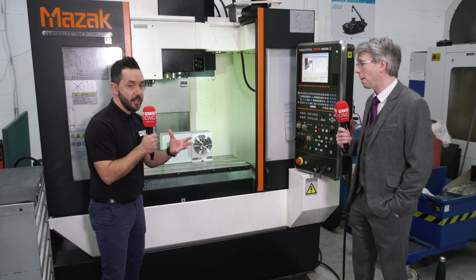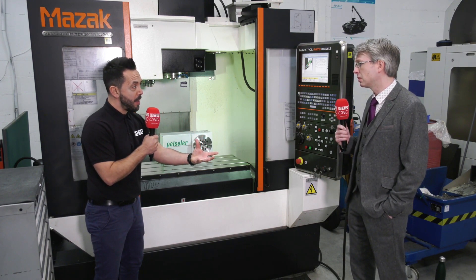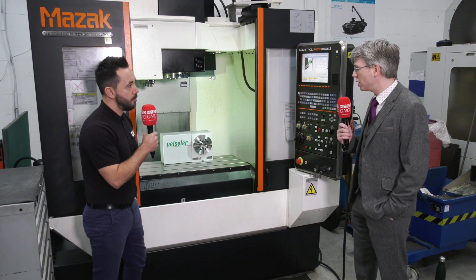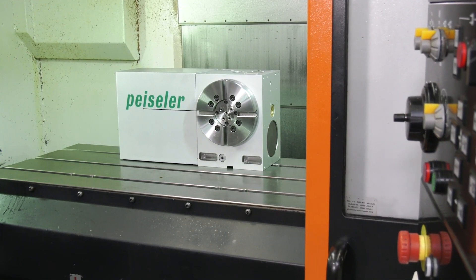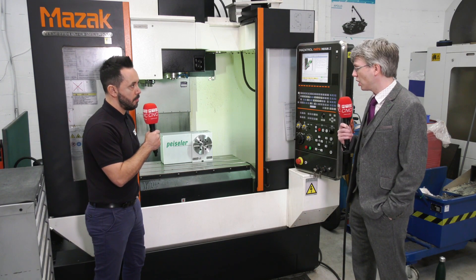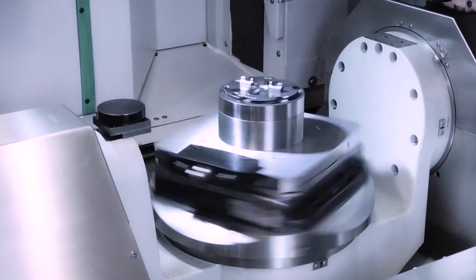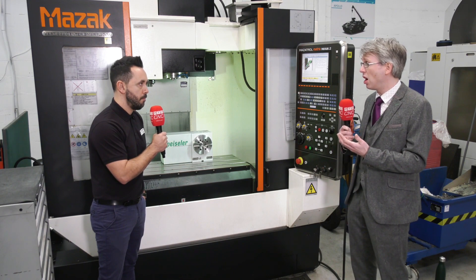So it's very accurate, but with this small footprint have you still got the rigidity you may need for hard materials and heavy applications? Very much so. The bearing arrangement and the square structure of the casting, with minimal machining to ensure the body remains rigid, gives you a good solid fourth axis unit. They also come with additional tailstocks — we can order them in a W-ATC version, and the tailstocks or counter bearings can either be an additional faceplate with a brake or a traditional live centre tailstock.